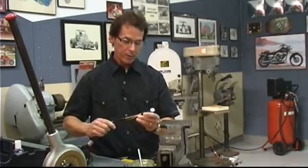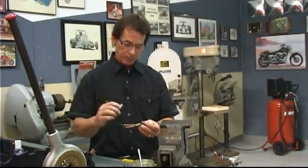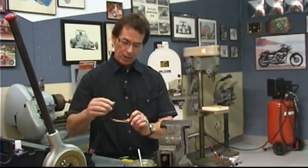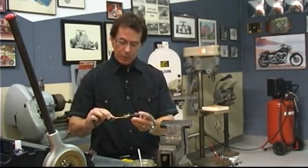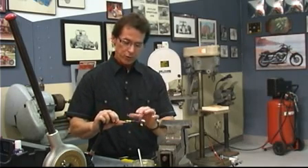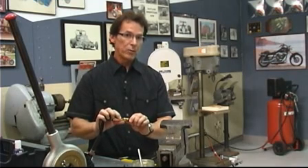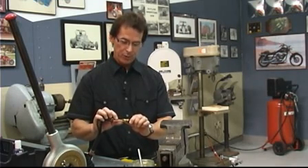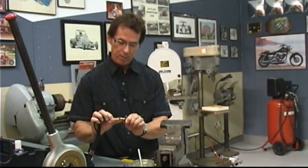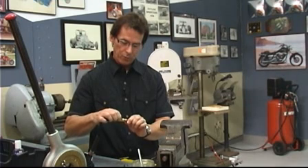Now you're ready to make your power and water connection. Typically that is a mechanical connection — there's a threaded stud on the torch body itself and one on the power cable. On a lot of these torches when they're silver brazed or shipped, the tubes get bent around and it can be almost impossible to make the power connection. The torch tubes are soft, so you can bend them back out of the way to expose the entire fitting and then simply thread the nut on.